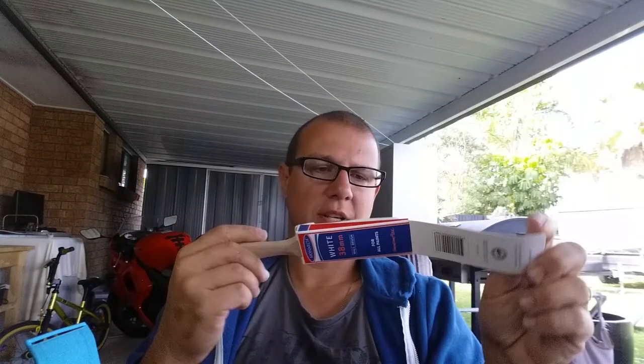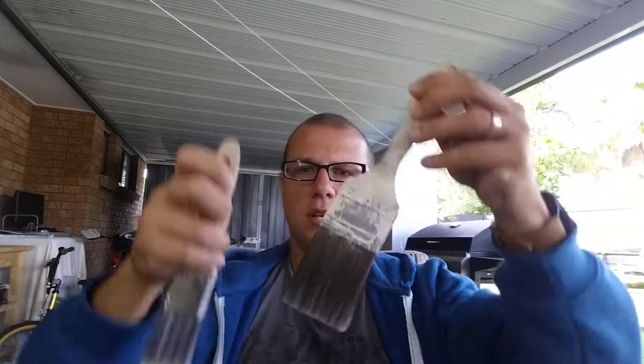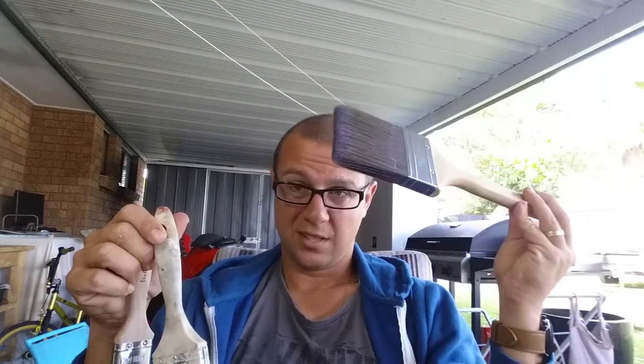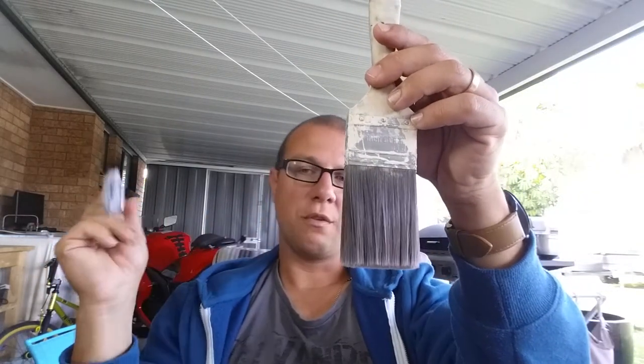I do recommend Monarch, and I recommend going slightly smaller just to get your hand in first. It also gives you good control in the corners with a 38 mil. Here's the side by side: 38 to a 50 - the 50 is much wider. And compared to a 75, a big difference. Some people even use 75 to do trims, but unless you are experienced I would probably stay away from a 75 - your corners are going to be a little bit tricky. It's all about control, so stick to a 50 or, if you're really new, a 38.